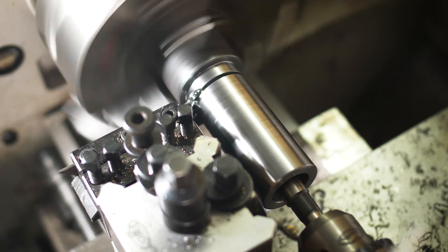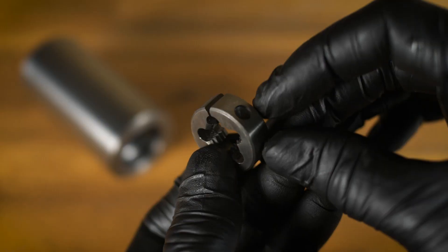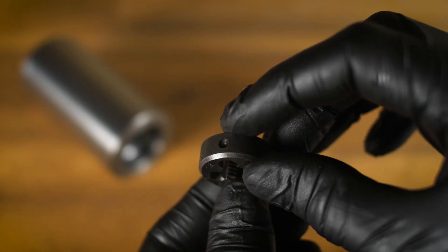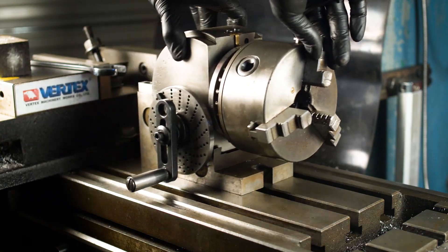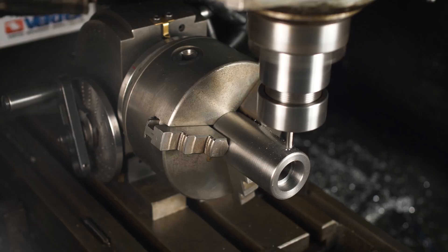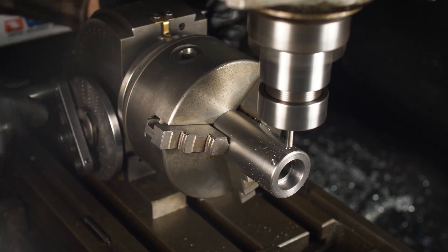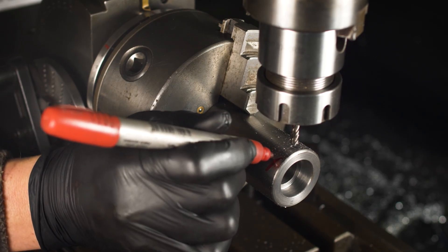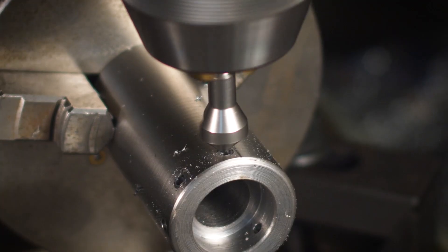Assessing my dies I have a few different retaining styles — some require three screws at 90 degrees and others have two opposing screws, so I'll make my holder to suit both types. I mounted a dividing head on my mill and initially spotted four locations for drilling — make that five locations because I miscounted. We'll just call that a maker's mark for extra style. After firing my cameraman for missing me drilling, I chamfered and then tapped the holes.